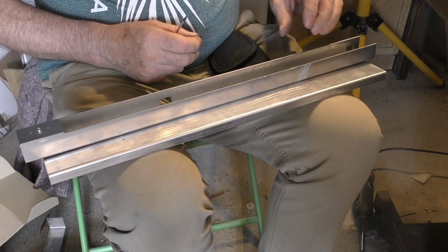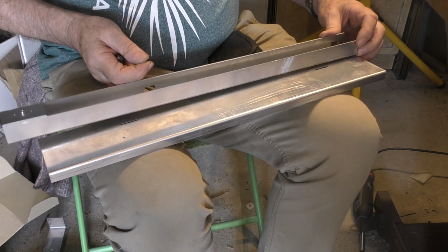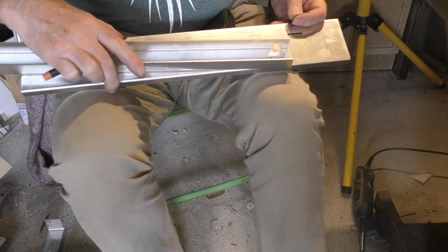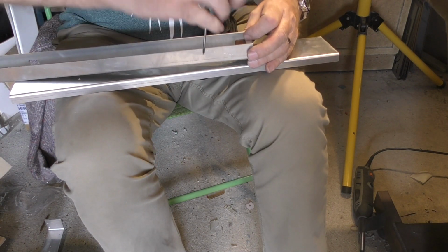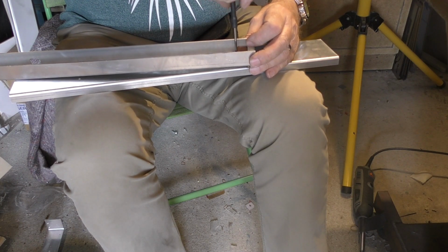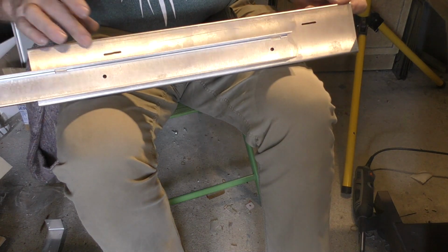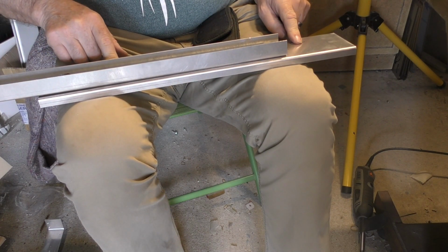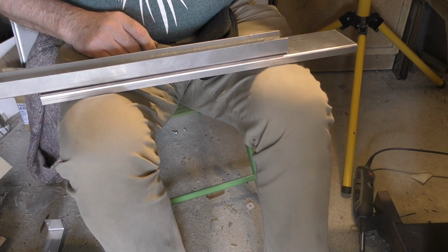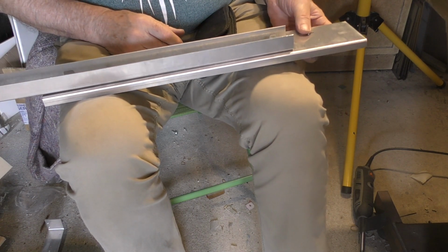A slight mistake on my part means that these holes in here in the bottom of this channel are a little bit on the big side, and they don't really tap properly. So we've got these M3 by 10 posi pans, so you screw those through the tube. The thread might not be very good, so it might get a certain distance through and then just drop through, and then fix it in place with a nut underneath, an M3 nut. And you should be able to spot through in the centre of these slots into the base of the tube enclosure and fix them down. I've got an M3 by 16 if you put a tapped hole in. If not, you'll have to put a nut underneath.